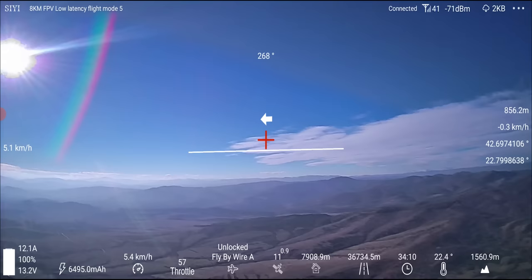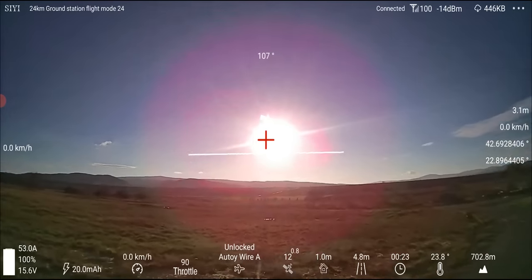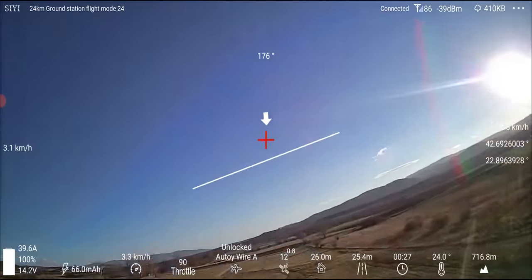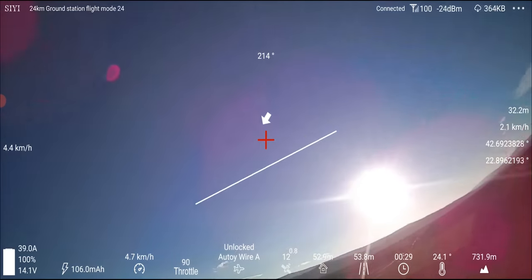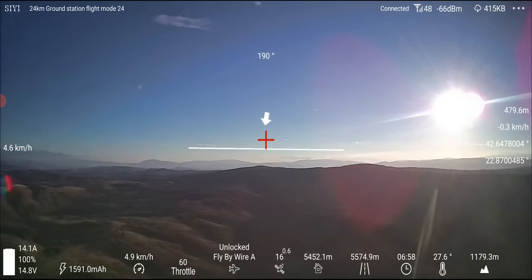The question is what kind of difference, and that is something I couldn't find explained in the manual, so we'll have to inquire about it. The manual states the system operates on 320 milliwatts and does not mention output power changes with the different modes. Anyway, I pressed on and just before the eighth kilometer the video feed froze at the 7.7 kilometer mark, which is pretty close to what is claimed by this mode, so my guess is this one is also hard-coded in some way. I flipped the return-to-home switch, the plane came back on its own, I landed, and before powering down I changed the mode to the 24 kilometer long range one for the next flight.